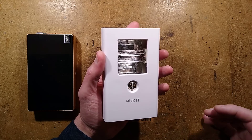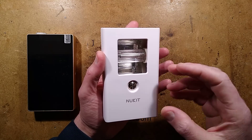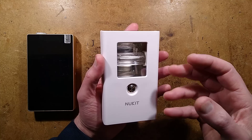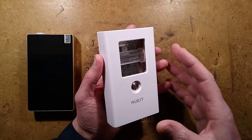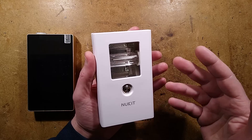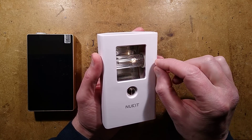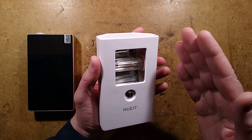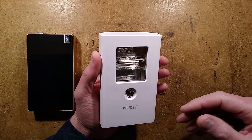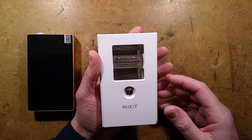This is a very exciting video to make. This device here, this new kit light, is a 222 nanometer wavelength germicidal light. What it means is that if you put this in a room and turn it on, it starts deactivating bacteria, viruses, and mold in the air. But interestingly, because it's a very specific and narrow wavelength — 222 nanometers — it is safe for humans. It will not pass through the outer layer of human skin or the moisture layer on your eyes, meaning you can sterilize the room while people are in it.